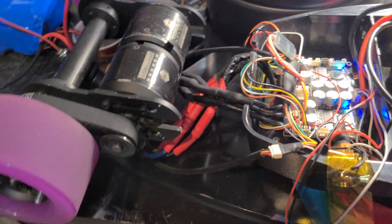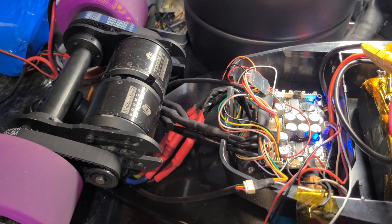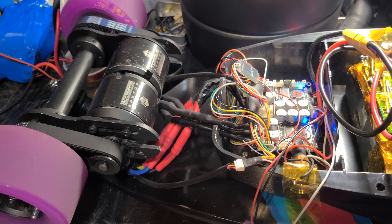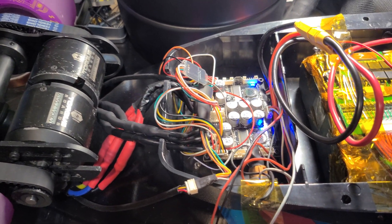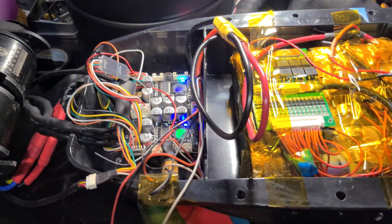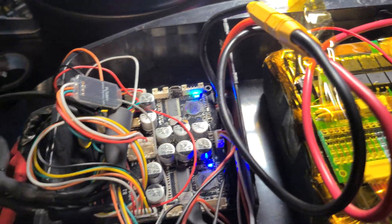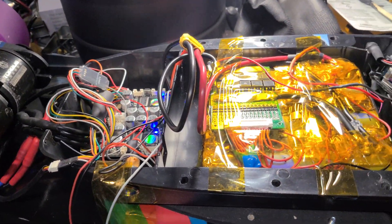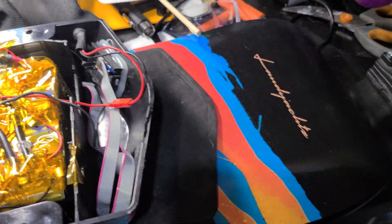This has a lot of power — about 4000 to 5000 watts, with 2500 watts per motor. I'm running it at 60 amps, which seems to be the sweet spot. I've also ran it at 80 amps. Running 12s, so 60 times 50 is actually more than 5000 watts — call it around a 4000 watt board.